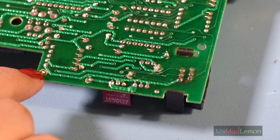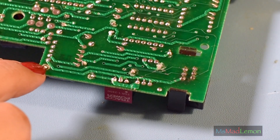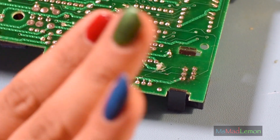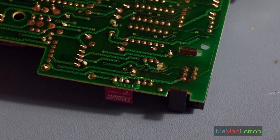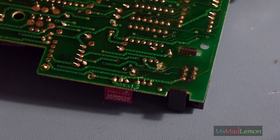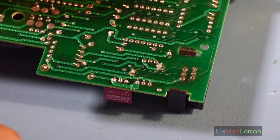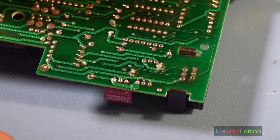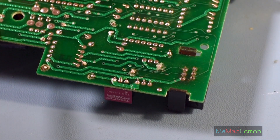One thing I've learned here is to not use the de-solder pump on this thing. I need a smaller nozzle, which I've ordered. What is concerning is that the board got singed on the part I used the pump. This is a pretty delicate board. So I'm going to turn the pump off and just de-solder by hand. I think a de-soldering braid is probably better to use on the more awkward components — definitely not those hand pumps, as they're clumsy and the shock from them isn't good for the pads. We don't want to be lifting pads here.